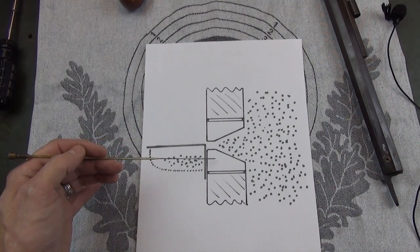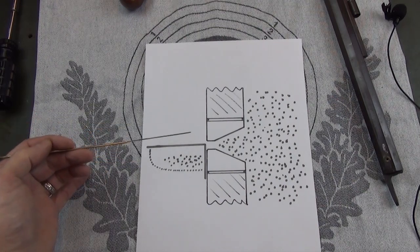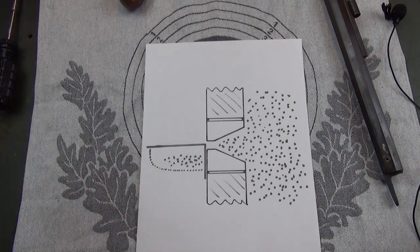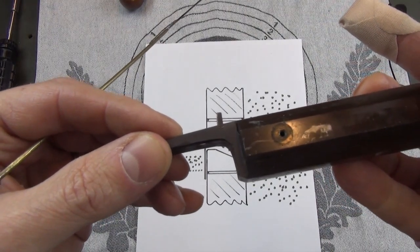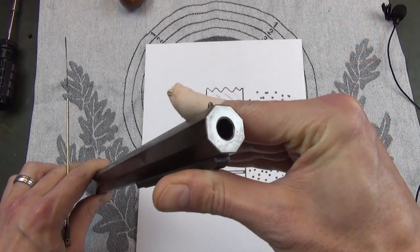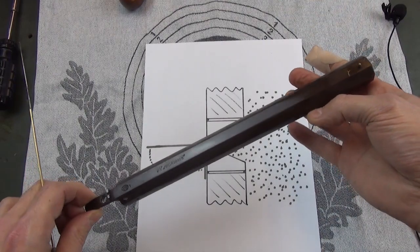These things are sacrificial — they would wear out eventually and you'd have to bore it out, or with a reverse-thread tool, take it out and replace it with a new one. Typically today these plugs come with an extra bit with some kind of screw slot or hex key slot; you put your screw into place and then file it off so you get a flush face with the little hole in there. Sometimes they have a little countersink. This one has seen some use but should still work fine. I haven't fired it because there's a complete lack of round balls in the right calibre in Switzerland at the moment, so I'll have to either find some elsewhere or get yet another casting mould.